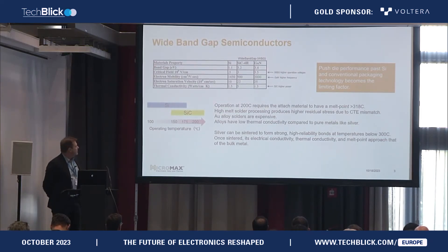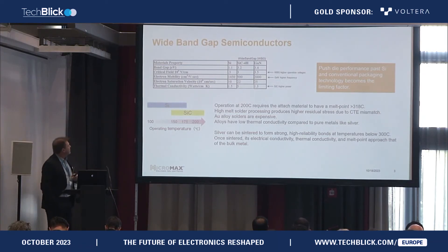The power density is going higher and higher. I'm not a specialist in semiconductor development, but you see and hear more and more that silicon-carbide-based chips and semiconductors are being produced. One big advantage is thermal conductivity — this allows silicon-carbide-based chips to handle much higher power. The next generation afterwards is already waiting, involving electron mobility, which gives freedom to work with higher frequencies.